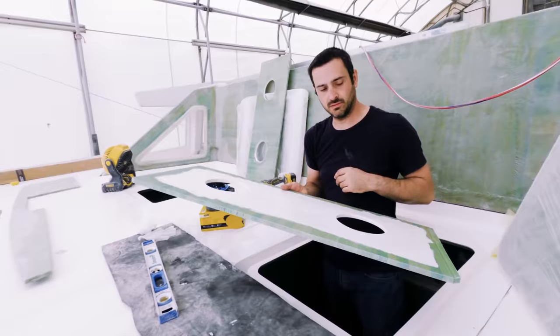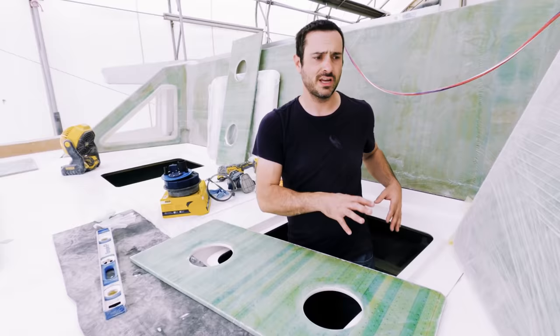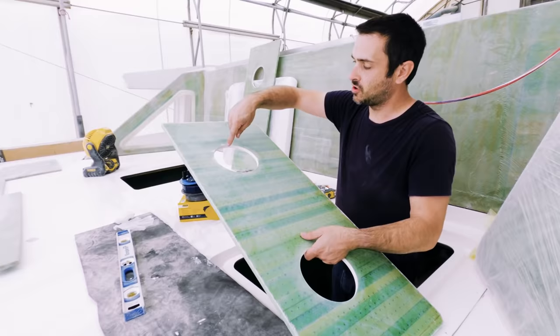Install the lids, the tops of our water tanks here, and I wanted to show how this is going to work. In between we have where that baffle is going to be, and then of course the outside area, which will get glassed into the bulkheads and into the webs on the side and across the front. So really a strong structure here. Jess has gone through the area that I cut out and filled that, so it is a good size. But this is the coolest thing.